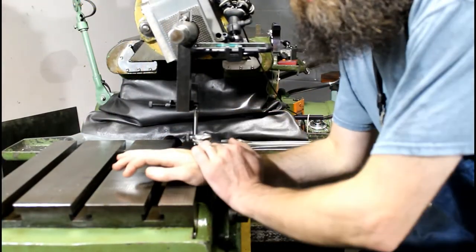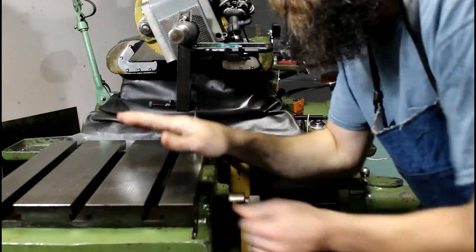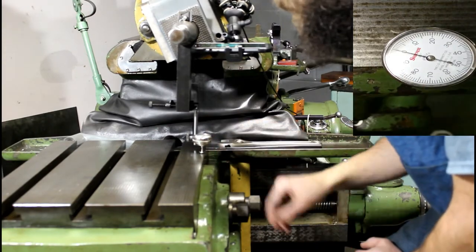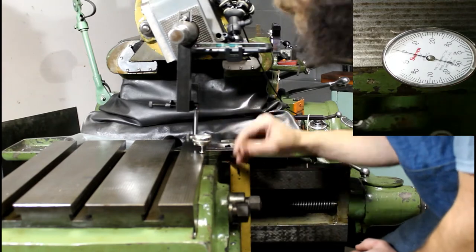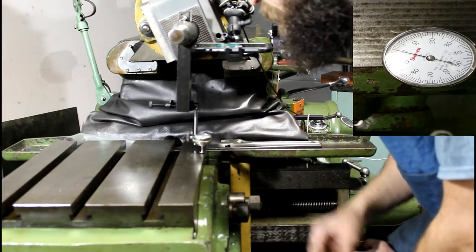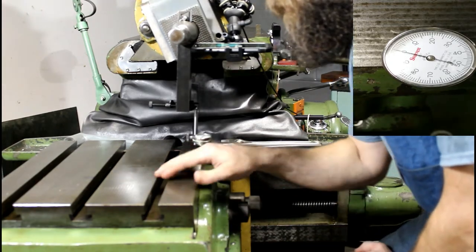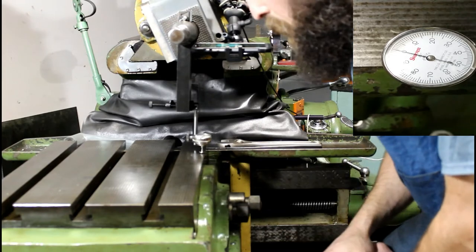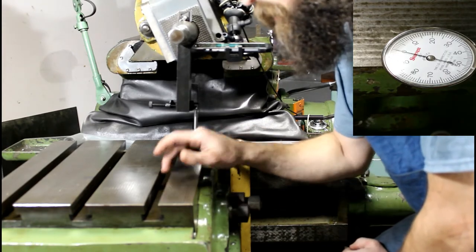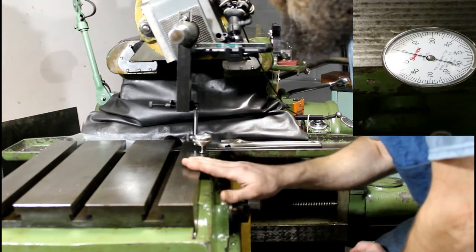Okay guys, we've zeroed the marks on the front of the table. We've snugged up the bolts so the table is not loose, but it's not tight either — we can still manipulate the angle that it's at. I've got a little Starrett 196 here, it's a great little indicator. The whole kit comes with a little C-clamp and all the snug and everything that you need for a shaper — a really great little setup. Got a little button bottom on the end of the plunger that allows it to easily travel over the T-slot slots. We've got about ten thousandths preload on it just because we don't want it to go too far down in these slots as we cross over them. We've brought it down and zeroed it on one side of the table.